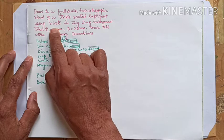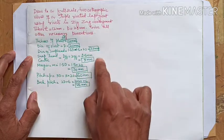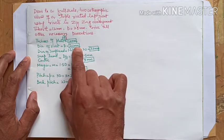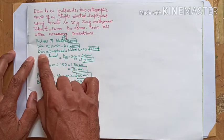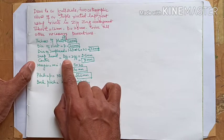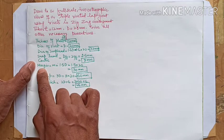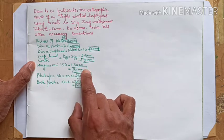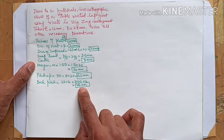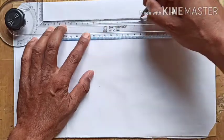With these two given dimensions, t and d, we have to calculate other parameters. Thickness of the plate is 12 mm, diameter is 20 mm. From the diameter we can find: snap head diameter is 1.6d which is 32 mm, snap head height is d/8 which is 2.5, rounded up to 3 mm. Margin is 1.5d which is 30 mm, pitch is 3d which is 60 mm, and back pitch is 2.2d plus 6 which is 46 mm.